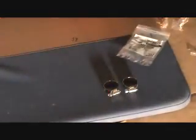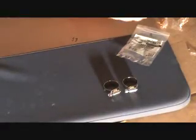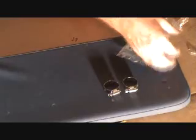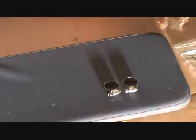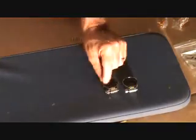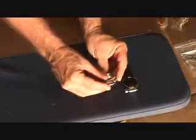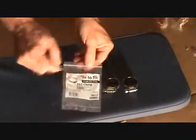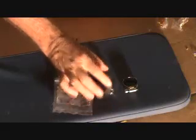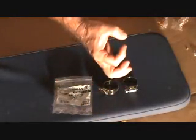That's why you've got to measure your pipe. I didn't measure that before I went to the store, so I found something I could buy at the store — the same type of dishwasher drain pipe — and then I measured the outside dimension of that before I decided which clamp size to get. Because you can get these in different increments. The last thing I want is one too small to go over the outside of my pipe, but I also don't want one way too big.